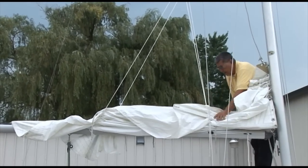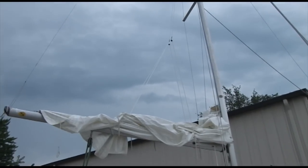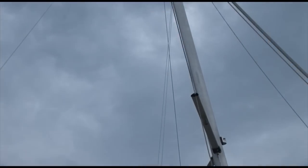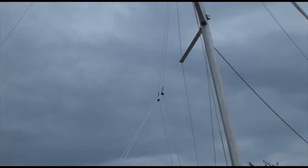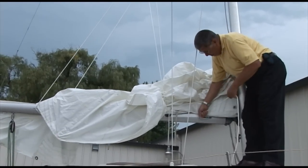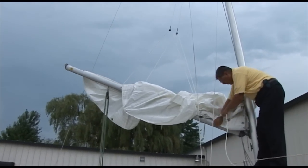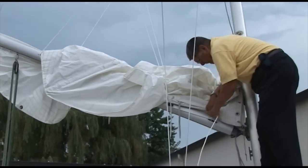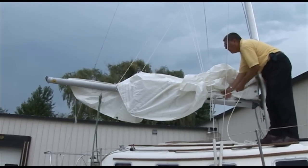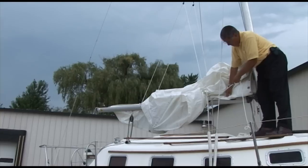Now it's just a simple matter of putting the sail cover over it and zipping it up. We got this video done just in time — you can hear the thunder in the background of storms rolling in. The written instructions talk about using shock cords at the lower spreaders to help hold the lazy jacks out, making it easier to raise the sail — that's an option. You can adjust the jack line, which is very handy. For instance, if you're in port and need more headroom, just pull up on it — you can raise it higher than the topping lift and secure it, keeping it out of the way of the cockpit. You can also lower it beyond the normal spot to catch the cockpit and let it take most of the stretch.